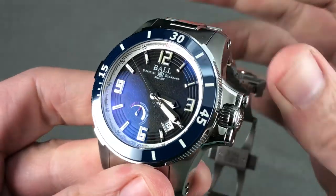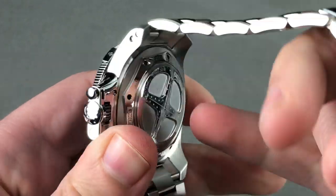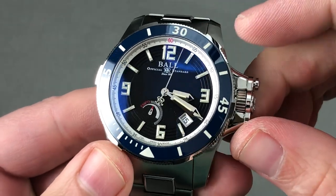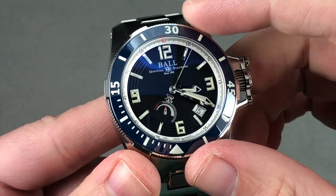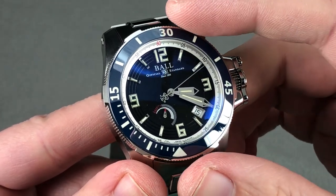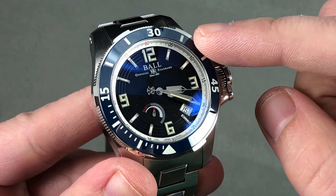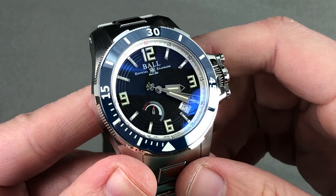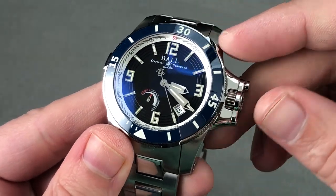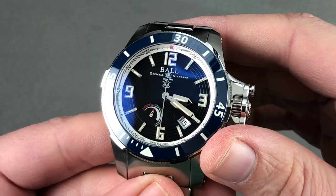I've seen Richard Mille with the Watchmaker Adjusted Variable Inertia Winding System, but that requires a watchmaker. This allows you to literally turn off the winding system. 21 jewels, automatic winding, 4 Hz beat rate, stop seconds, quick-set date. This is an ETA 2897, I believe, with the power reserve, and a top-grade, highly adjusted ETA movement hugely customized by Ball to include the amortizer. The timepiece features a power reserve, date, amortizer, crown device, captive bezel, and proprietary bracelet — you're getting a lot of in-house tech with this watch.